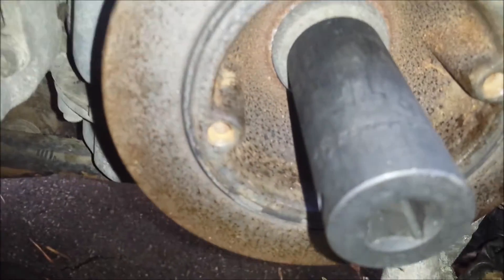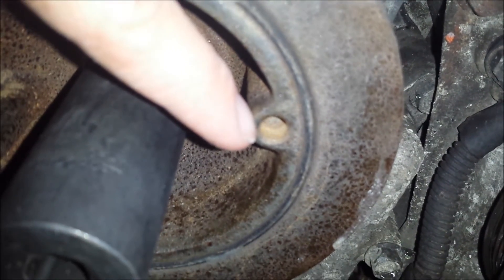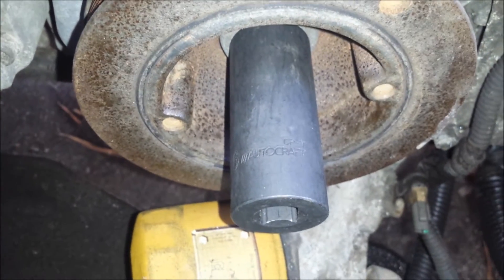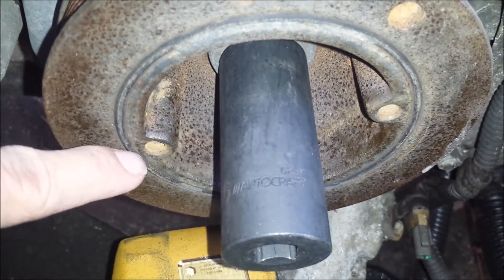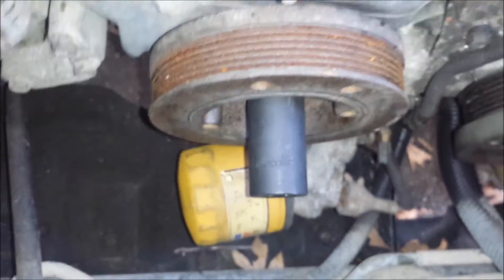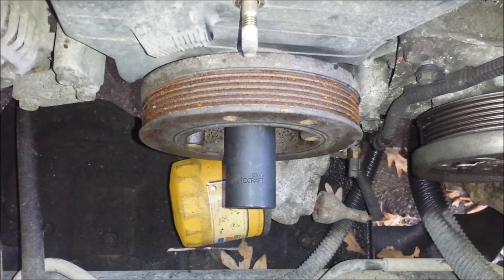Let me show you the pulley again. If you look on either side of the socket, you'll see some threaded holes — one here and one here. That's for those M8 by 1.25 screws to thread into. So we're going to put a large hole in the center for the socket to fit through, and on either side we'll have a hole for the two machine screws to bolt the flat stock tight to the pulley. Then we'll be able to crank the nut off. Let me go ahead and get the flat stock marked up for my holes and we'll start drilling.